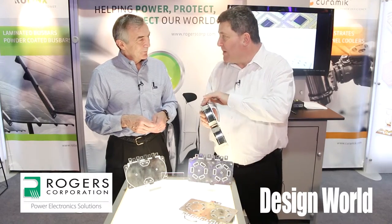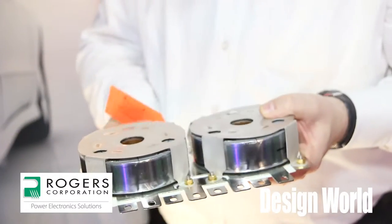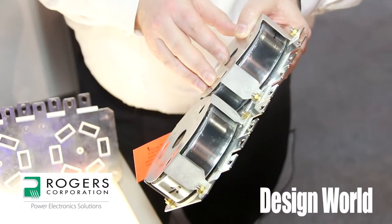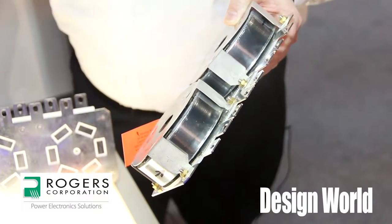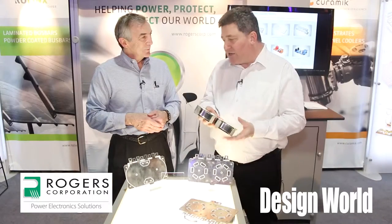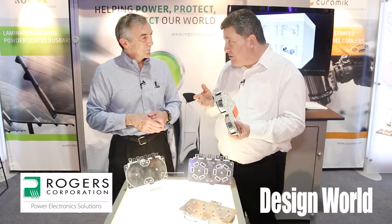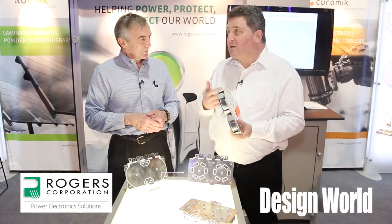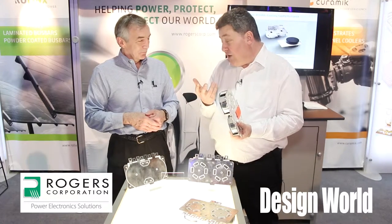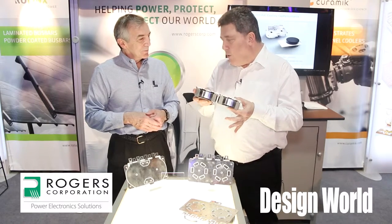And by the way, these are film capacitors. Applications would go into solar inverter applications, or anything with wheels — hybrid and full electric cars, but also garbage trucks, start-stop vehicles, delivery vehicles — where you need to recuperate energy and where weight and size are important. That's really where this is aimed at.